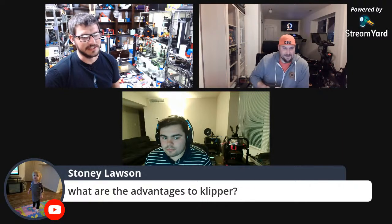Yeah. So Stoney's asking, what are the advantages of Klipper? So Kennedy, if you don't mind kind of explaining that, because I'm just learning it, so I'm definitely not the person to say. So it's really like a personal preference, and also there's some advantages in some cases. The big thing with Klipper is that it runs on the Raspberry Pi, so you have all of that processing power that you don't get from running standalone. I'm not going to go into 32-bit because it's about the same performance wise, but if I wanted to, I could build a printer right now, run it with a RAMPS board, and get more performance out of the RAMPS board than I would running a board standalone with Marlin.